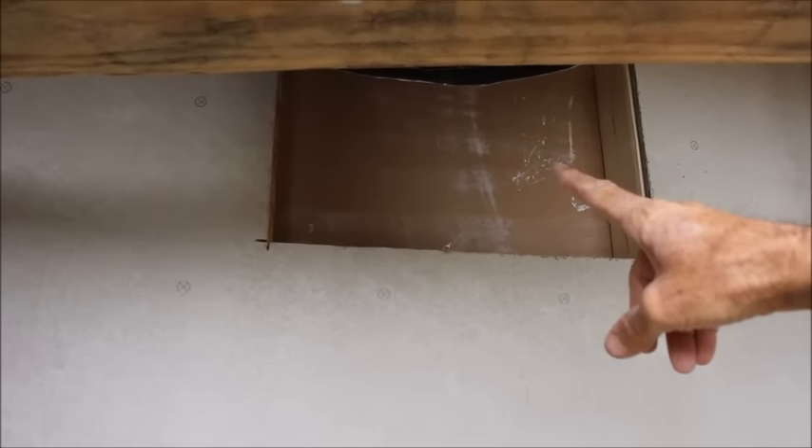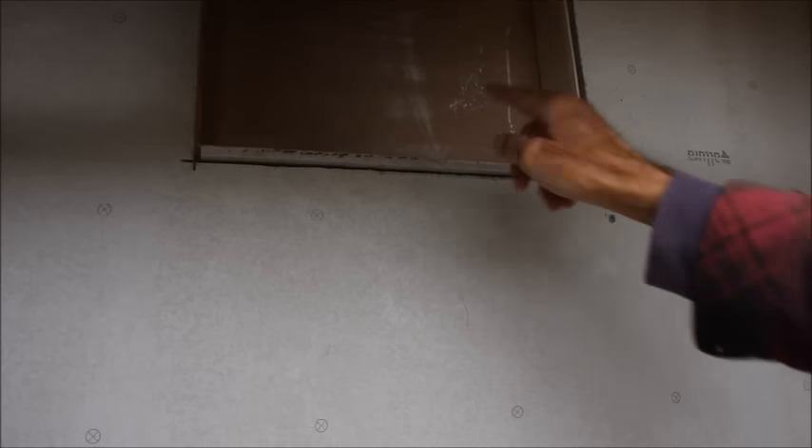We put the cement board above the wafer board because this area right here is where our flue pipe is going to be coming through with our thimble. For safety purposes, I would rather have cement board next to it. I'm a precautionist — I take every precaution. I'll come in here with another layer of cement board around these studs so that there's never any contact with wood anywhere through the thimble. It will always be cement board all the way around this hole. We're not going to put this in right here until we actually cut the sheetrock out on the other side, so that there's nothing but cement board in contact with the heat at all times.